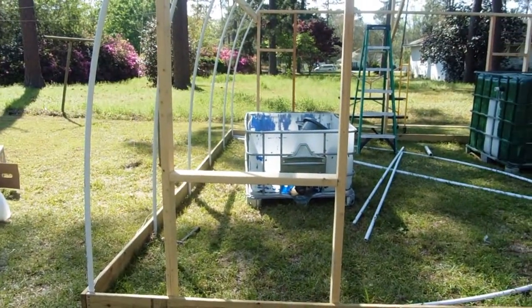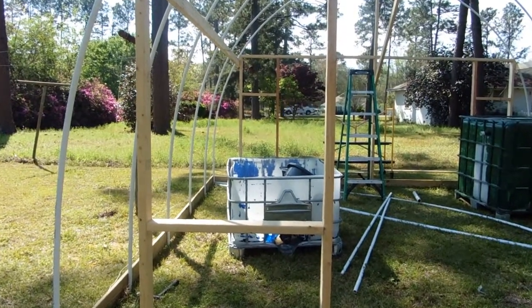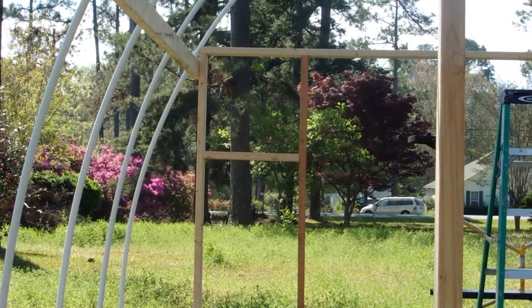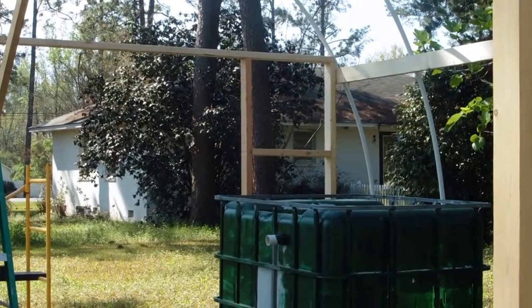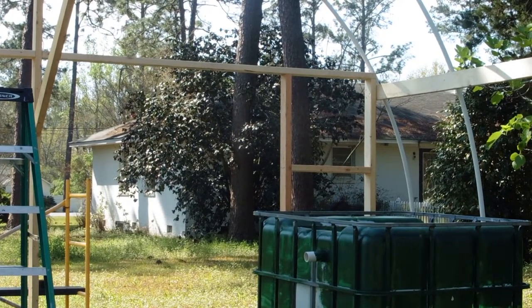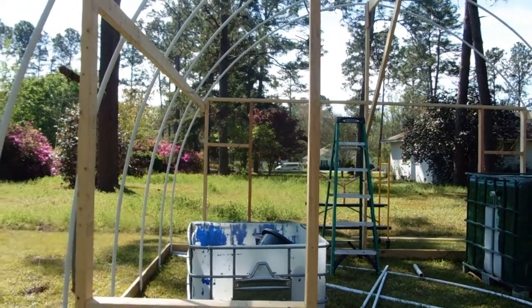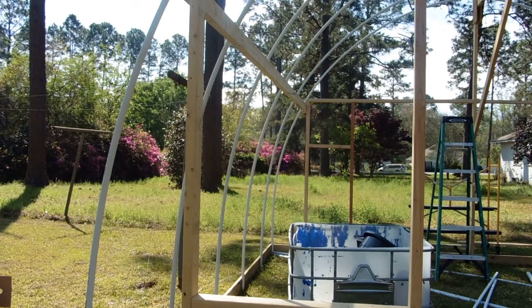Back there in the very back where the box fans are going to go, the opening is 20 3/4 by 20 3/4. It's one right there, and then there's one on the other side, the same size, 20 3/4 by 20 3/4, framed up. The support that runs across is a 2x6 for the PVC, and a 2x4 runs the length, 16 feet long, to support on both sides.